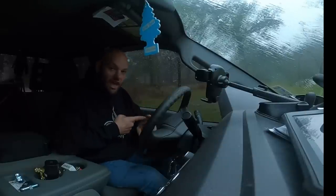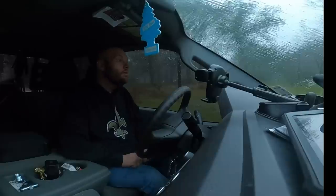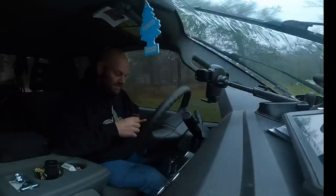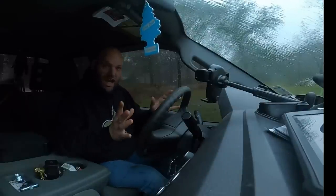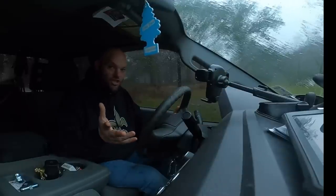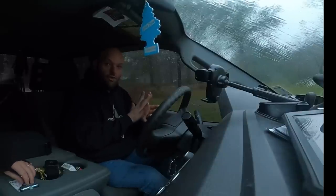The plenum has no tape, no screws, nothing. You can just freely move the plenum. The drain line is a mobile home flexible drain line that is not sealed in any kind of way with glue or nothing. It will leak like a sieve. Y'all saw the expansion valve bulb. It was just zip tied and dangling. It wasn't even touching the copper to read temperature.